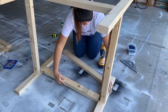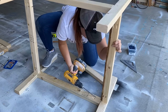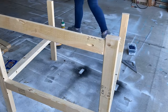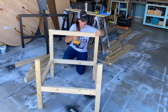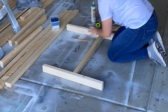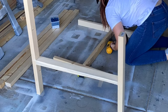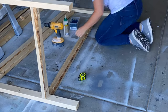I wanted to attach the back piece, but I didn't want the screws or the pocket holes showing on the front. So I decided to flip the chair over and finish doing the seat completely, then stand it up to attach that back piece. I was learning as I did this first chair. Now that it's standing up, I can attach this cross piece with the pocket holes in the back and some glue. These chairs are really large — my customer was able to find some great cushions on Wayfair.com that were 28 inches by 28 inches by 6 inches thick. They're really nice cushions and made for really comfy, spacious lounge chairs, so it was perfect. Now I'm making another arm and going to make all the arms for the couch and the other chair, then attach the cross seat pieces the same way as the first.